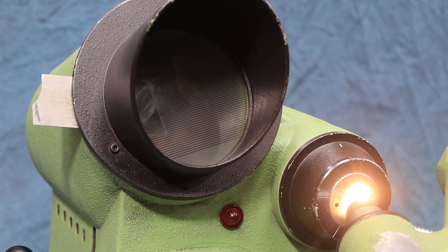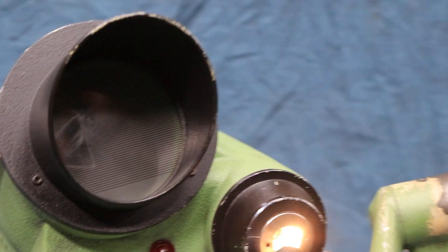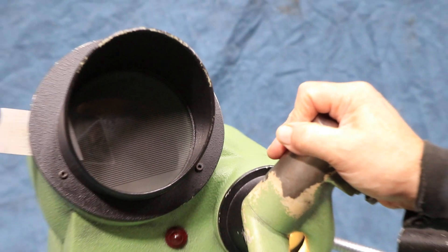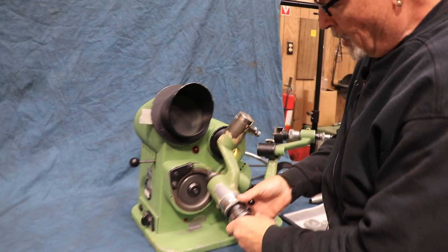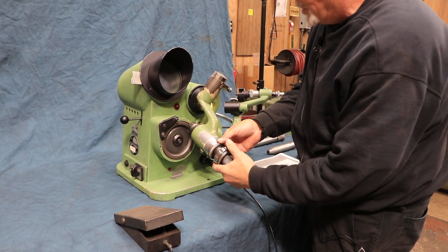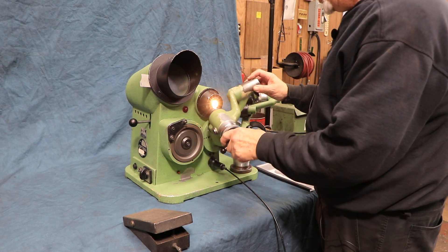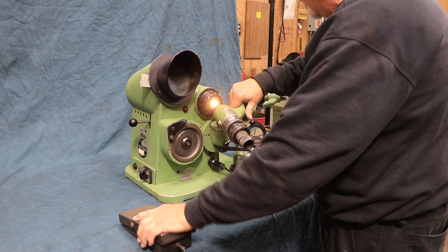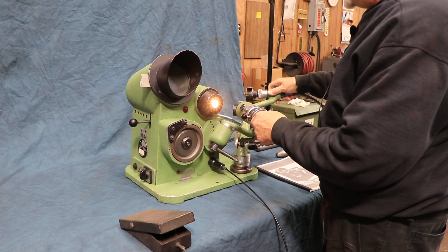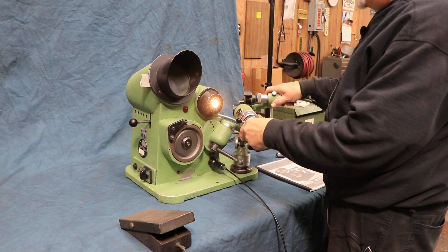The idea is to replace this lens once in a while because it's just glass, but it's made to put the tool right up against and that gives you the cleanest picture of your tool. Once you've done that, you can swing this whole thing right over in front of the wheel. You push this in, rotate it 180 degrees, and grind the two flutes — it can be indexed. Then there's a time when you'll want to go all the way over and do point thinning, where you thin the point or the web of the drill.